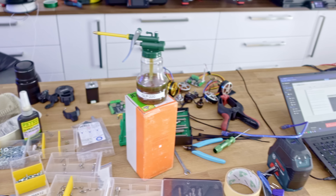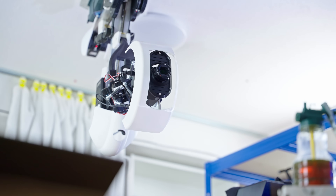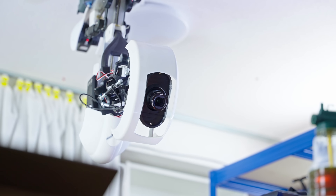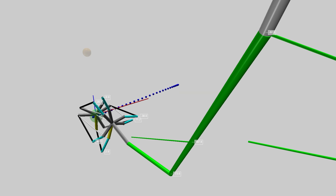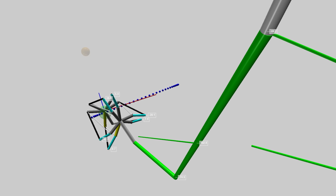Because I have full control over how this motion is generated with my own IK solver, how exactly these moves look and play out is completely open. For example, what I want to implement next are orbit-style shots, where instead of moving like a slider on a straight line, the head keeps a constant distance from the subject and simulates a sphere move. I think that could look really cool. Also right now I'm using a video game-style acceleration curve called smootherstep, but I can change that to include some style of input shaping as well. I'm dividing the entire move I want to do into 20 segments per second, then streaming those segments with the appropriate acceleration and speed limits to the hardware.